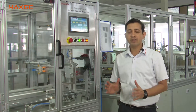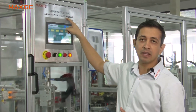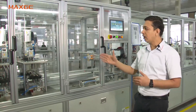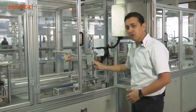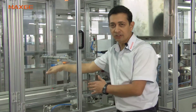Now we are at the testing station where two parameters critical for the temperature rise test are checked: circuit resistance and lift force — which is essentially contact pressure. The barcode is scanned again, and these two parameters are checked automatically. If an MCCB is disqualified, a dedicated station automatically removes it, allowing only qualified units to proceed to the next stage.